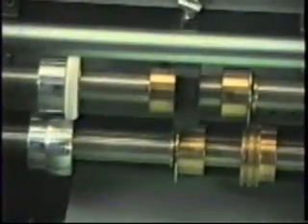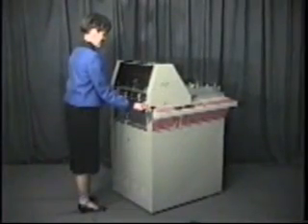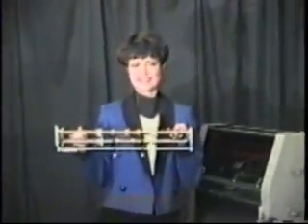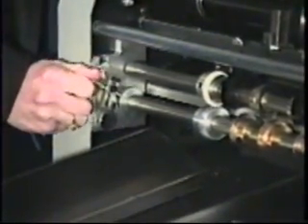All blades and hubs are a heavy-duty, one-piece design. The perforator is similar to our famous Perfomatic units and is available in 1/16th-inch, 1/8th-inch, or 3/8th-inch cuts. By removing two locking pins, the entire delivery assembly can be pulled out of the machine for adding, removing, or rearranging finishing assemblies. The shafts have locking depth adjustment levers to change depths of scoring for various stock weights. You can combine any or all of these operations with or without numbering and marginal imprinting for one-pass finishing with true professional results.